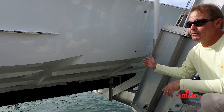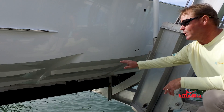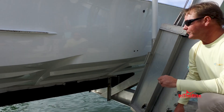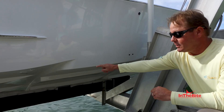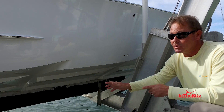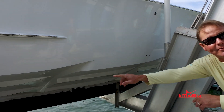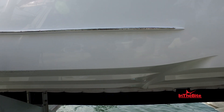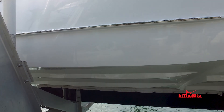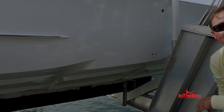Step bottom boats are known for their handling characteristics where, if you're going into a high-speed turn, it might swap ends due to losing ventilation on the transverse step. But due to this design, you get air from the front as well as the sides, so it eliminates that possibility. Also, in high-speed turns it banks on the edges of the longitudinal steps back aft, so it tracks very securely at high speed. So far we haven't really come across any shortcomings on the design as far as performance and efficiency are concerned.